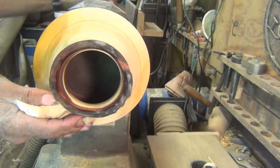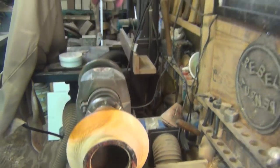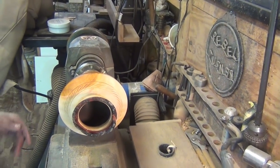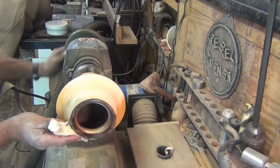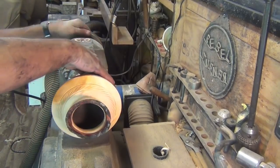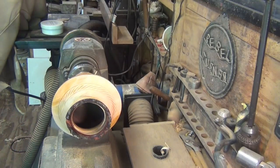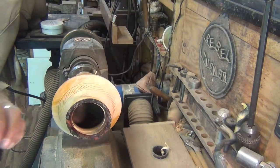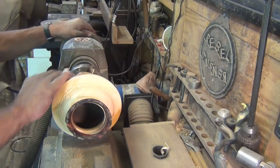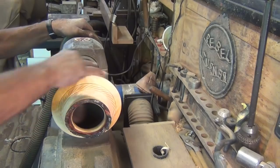And prior to this, I used to use sanding sealer, or else I couldn't get a good finish. Different woods absorb the finish different from each other. You can do the same technique from one piece to the next, sand it just as much, even in some cases, sand the one piece more than the other, and the one you did less sanding shows up better than the one you spent more time sanding. And that's all based on the wood. If you're applying this, or applying a sanding sealer, it enhances the wood a great deal, and you get much more uniform finishes than you will otherwise.